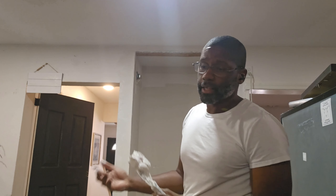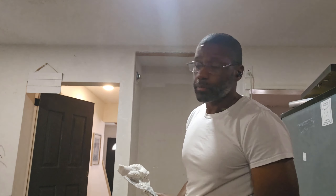You can see how it looks going up — just enough. I'm going to be smoothing out this entire spot instead of having just some of it be smooth. Might as well smooth out the entire wall right there. Same thing with this side — you can see how that looks going straight up. For the top, doing the same thing as I did on this side: use plaster, then get the tape, put it on, a little more plaster after that, then let it dry.